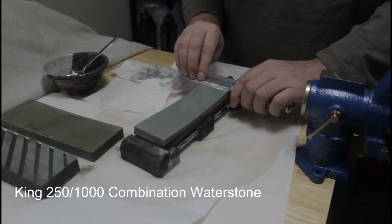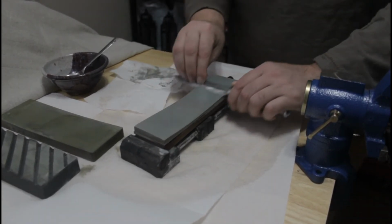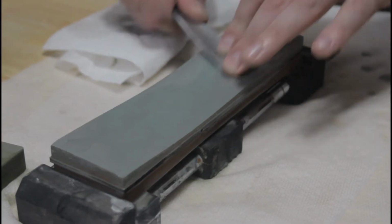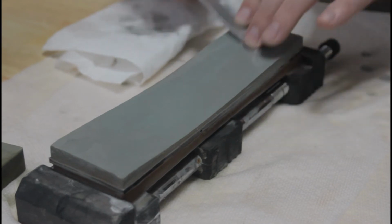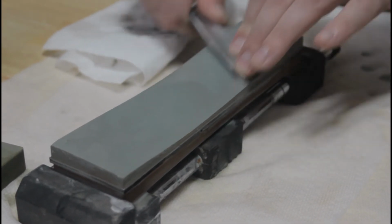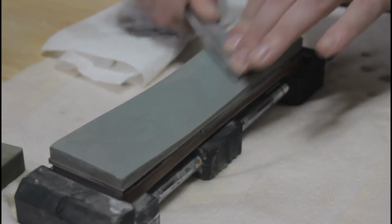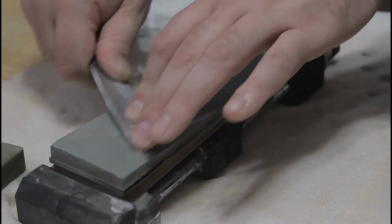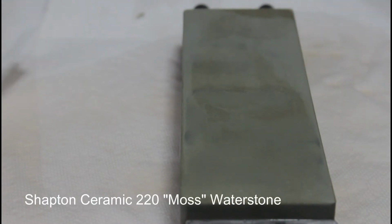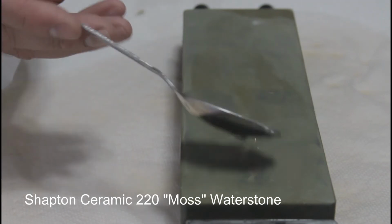Now we come to my favorite part of the process, sharpening. And let me confront the 900-pound gorilla in the room right now. Yes, I know my stone isn't flat. This is deliberate. These King brand stones wear out so quickly that if I flattened it every time I used it, this stone wouldn't last me a week. I sharpen a lot of stuff, and I reprofile a lot of edges. That kind of work is hard on water stones, and that's just the way it is.